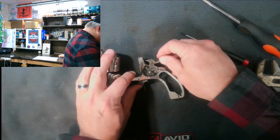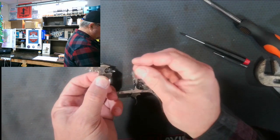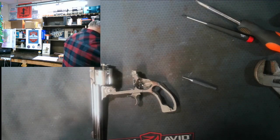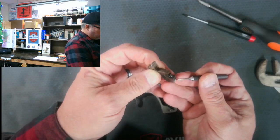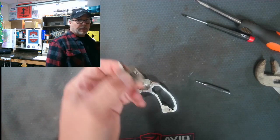At this point everything is free. Work the hammer out — it comes right off the hammer stud. The hammer is out. This is the old hammer with the stirrup and the pin — the pin is really super tiny. This is something we're going to be switching out. The rear sear catches the hammer right about here and it really does seem to be pretty worn out, so we'll have to do some testing because that's what's stopping us from going into single action mode.